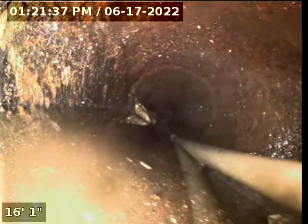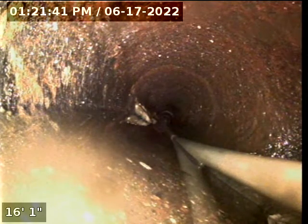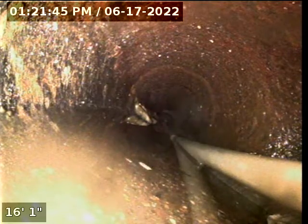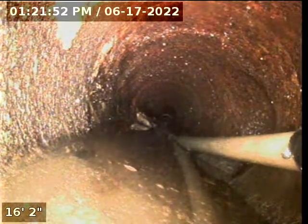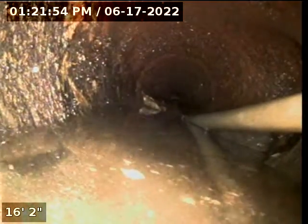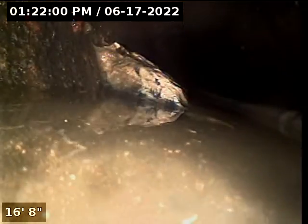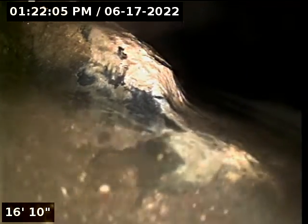Work order 3787 again. Ran the chains now several times, we are getting somewhere cleaning the cast iron pretty well. But whatever this build-up is, it's really hard. You can see to the right — that's where the toilets connect to the main line, and right after that is where this starts. It's hard to tell what that is; it shouldn't be built-up grease because the chains should be able to cut that out easier.